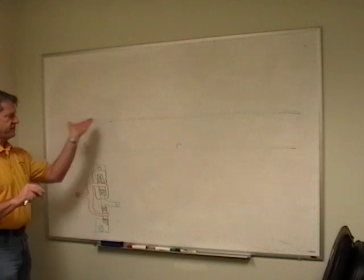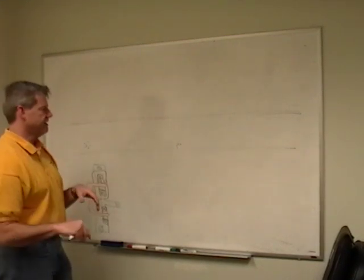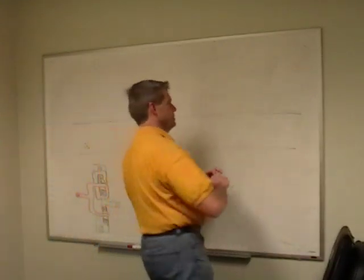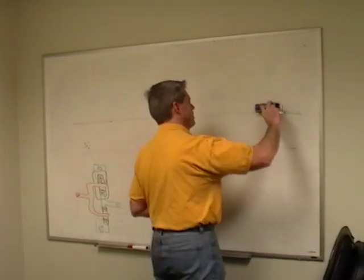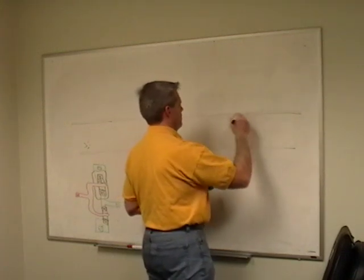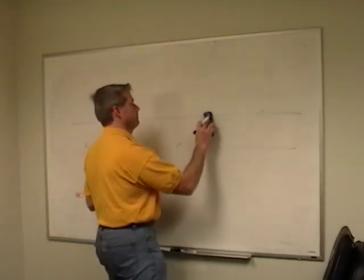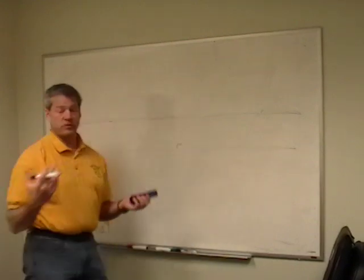And this is like film, right? There's a reaction due to the light. Then you take it out and you dip it in a developing tank and develop it just like you used to do film in the old days. Sometimes some people still do it. And then you put it in an etching process, and the etching process is going to pull off here where you want your deposition to happen. I'll make that a little wider. And then you put it in an oven.